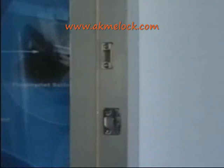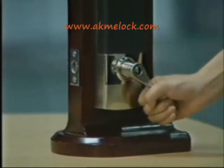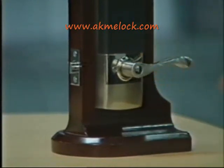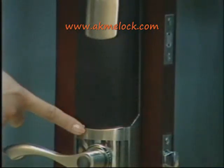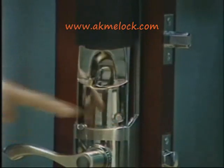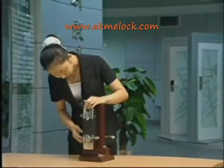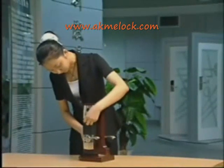After installation, we need to check the following operations. If there's no saved fingerprint, when the inside handle is rotated, the latch can draw back freely. Press the outdoor locking button — the deadbolt shoots out. Push the sliding cover up and press the power button — the lock set automatically unlocks and the deadbolt shrinks. Check out the handle.